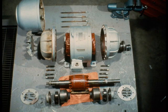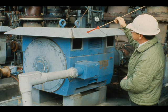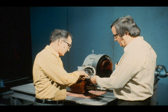That completes the disassembly of our electric motor. As you have seen, the process is relatively simple compared to much of the equipment now in use at your plant. However, larger versions of the motor we have shown may not be quite as simple. Some rotors are very large and very heavy, requiring the use of cranes or hoists to remove the end bells and the rotor. Another factor that may complicate things is the enclosure — it may be necessary to take the enclosure apart before you can get to the motor itself. However, there are two basic sources of information which should be of tremendous help if you encounter problems. The first is the manufacturer's manual, which should have cutaway drawings of the motor you are working with and may even have tips on disassembly. The second source of information is your supervisor or other workmen who already have experience in this field. There is no better source of information than those who have done the same job before you.